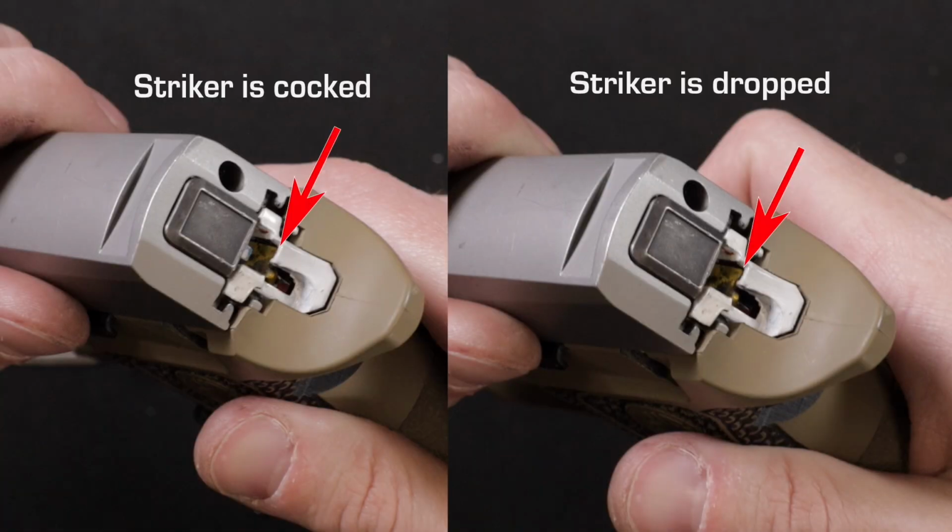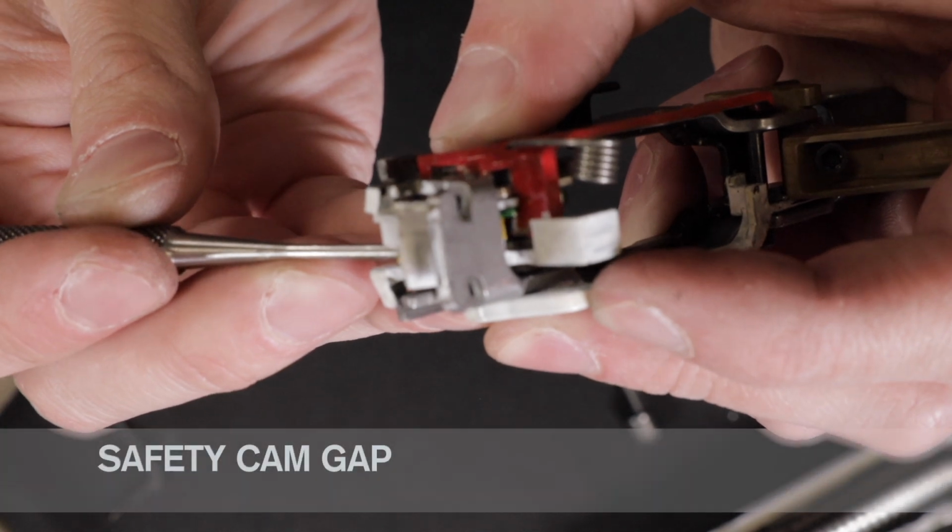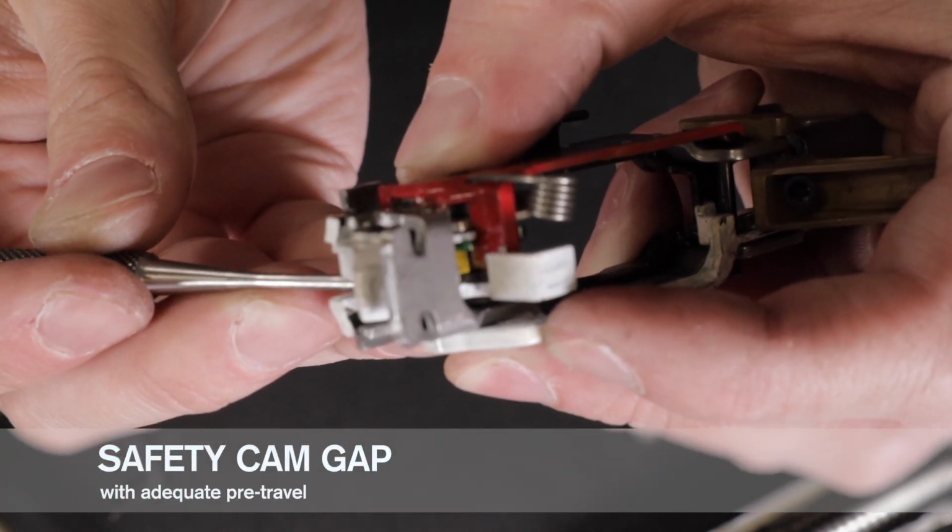When the slide cocks the striker, the Sear floats up to catch it. It only drops into alignment with the trigger bar after the striker is fully cocked. Another layer of built-in safety. That's why just pushing on the Sear out of context doesn't reflect real behavior. It's designed to interact with a full working system, not as a standalone piece.